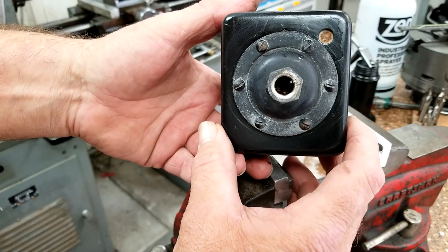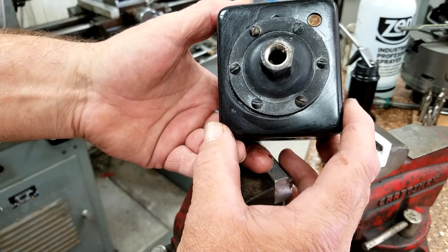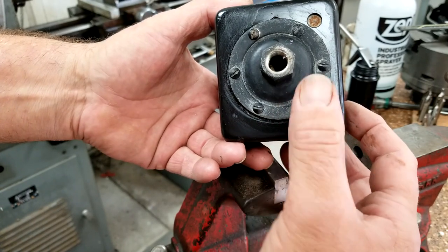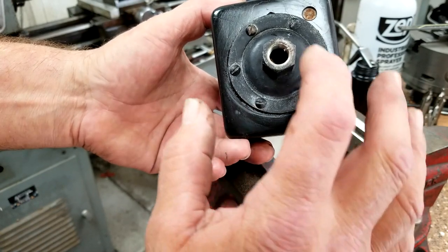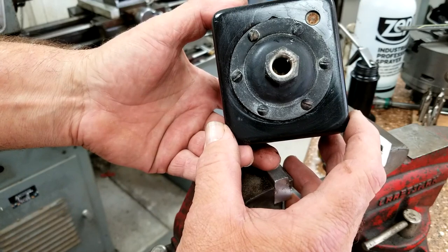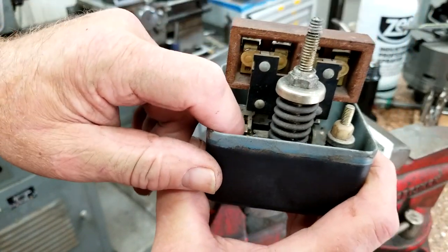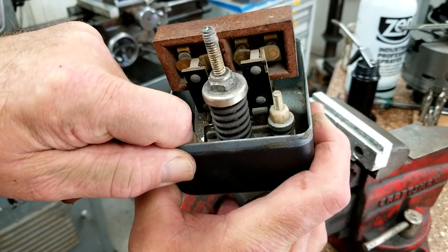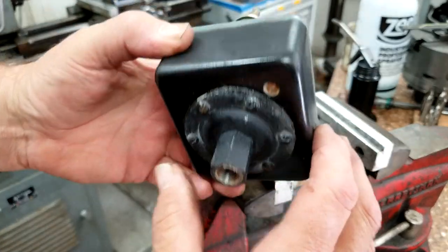She's all back together. I put the diaphragm in with a little bit of gasket shellac just to make sure it's sealed tight against the case. It's a non-hardening Permatex — they call it an aviation-type gasket sealer, it's a shellac. I only did the outer rim; the working center part I didn't touch — you want that to stay soft and pliable. I wiped that center section down with a little brake fluid, which is surprisingly good for rubber and will keep it supple. The contact on the left is clean — you can see it — and the one on the right is still untouched, but the left is the one I'm using.